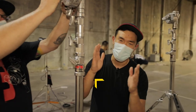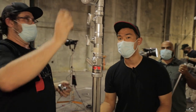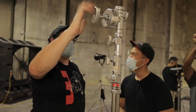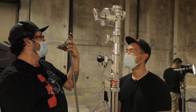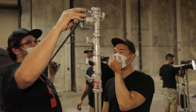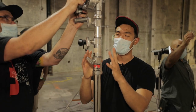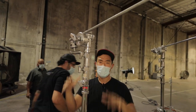We are only rigging super light fixtures on here right now. However, a lot of the time — especially as we'll be showing — you're going to have heavier lights that need to go on the system too, so this adds a lot of security for that scenario. You never know what they're going to add to it later. When you start rigging something, I always rig it for the heaviest thing that can go on there — twice as big — because you don't know what someone's going to end up showing up and saying, 'We need a 20k up there.' I just start out with the biggest, baddest stuff I have because I know it always has potential to grow.